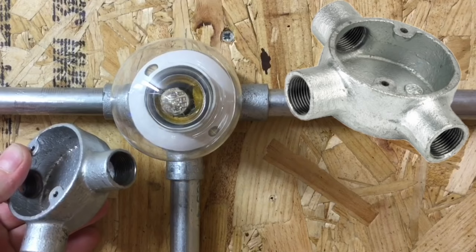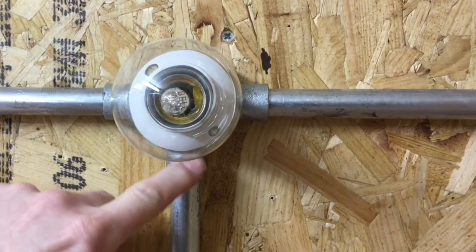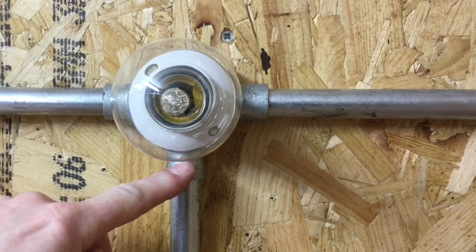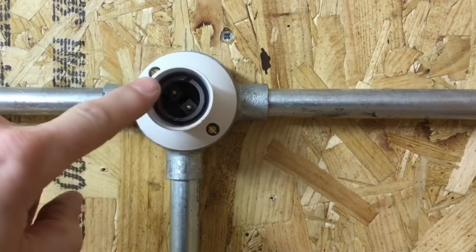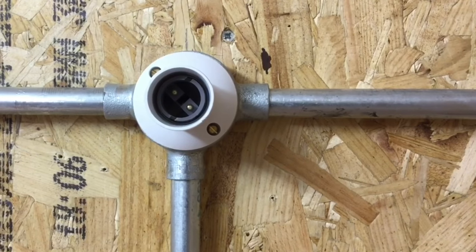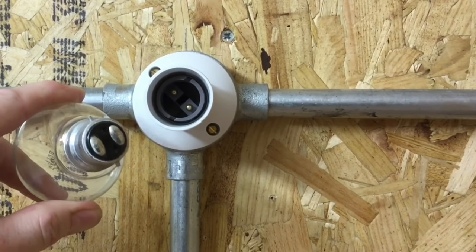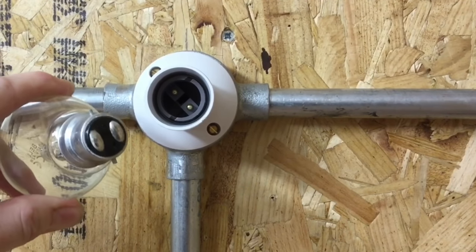For the lighting points, we installed spouted boxes — in this case a tee box. The inside of the spout is pre-threaded, so the conduit is threaded underneath and inserted into the box and tightened off using a pair of grips. The lamps we were using had two pins — these are batten lamp holders and they take a bayonet cap lamp. It doesn't matter which pin is line and which is neutral, as these styles of lamps have no polarity.